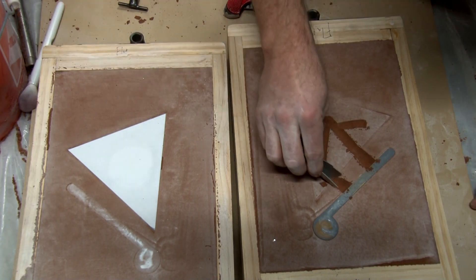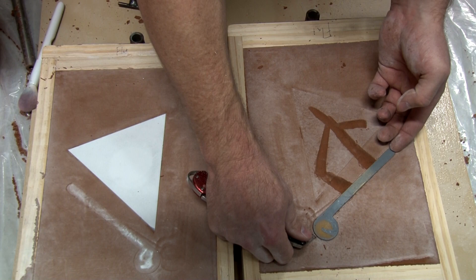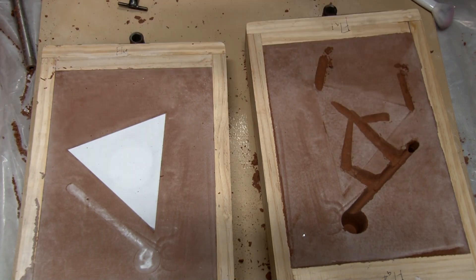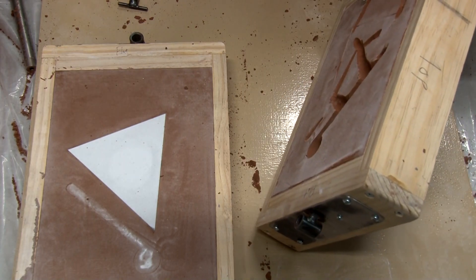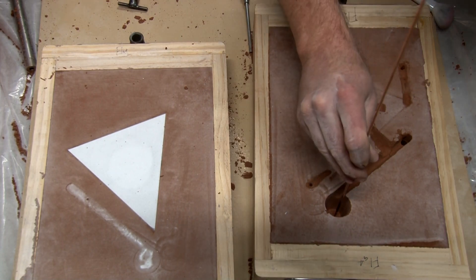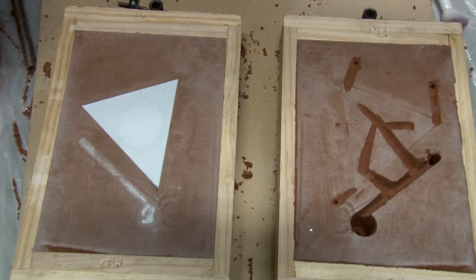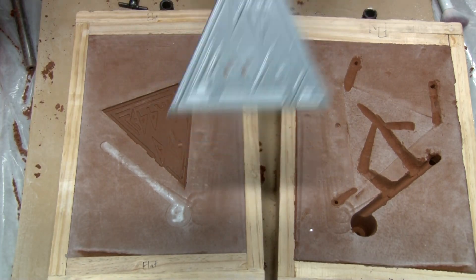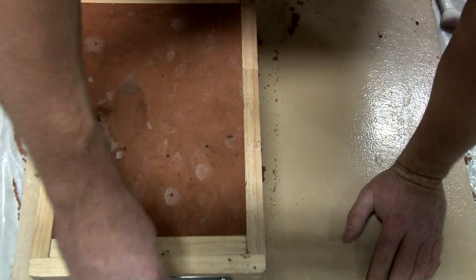So this is one way to get around a thin part — just put a lot of gates or channels on it, and that way the aluminum has a better chance at running all over the mold. If I'd just had one gate, I think it would have poured short and the aluminum would have frozen up before it got all the way through the mold. I'm putting the air vents at the corners of the mold — that should be the last spots the mold fills up with aluminum. Again, just blow all the sand out — that's really important, otherwise those little sand grains will fall back down into your cavity and cause inclusions in your casting. You can see there's a little bit of tear-out, where the pattern actually pulled sand out into the holes, just like I talked about in the introduction.